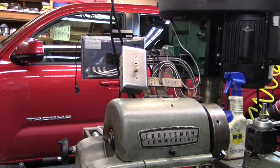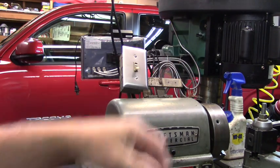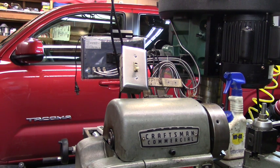So I opened it up, and it needs new wires anyway. The insulation was cracking and falling off. But instead of looking at the papers, I went in my drawer where I keep the manuals and such. You can see this stuff flaking off of the wires there. Anyway, I dug out the old moldy sheets that came with the thing, and it says I can use that reversing switch, but the off position won't work. You have to use an extra switch to make it work. So really and truly, I had it wired right in the first place, and if I'd realized that, I would have paid more attention to which screws the wires were on, because now I got to trace each one of them as I put the new wires on to make sure I get them right.